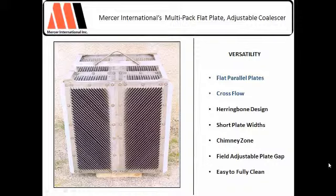Phil mentioned the upflows and the downflows — they're both counter-current, meaning one of the components, like solids, has to fight against the flow of water. When it does that, it tends to ramp up and plug. So if you move this to a cross-flow design like we have here, water's flowing here.